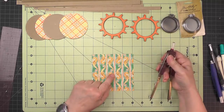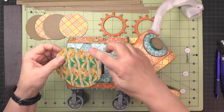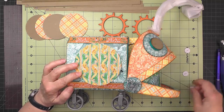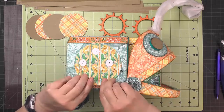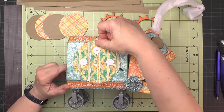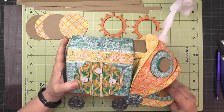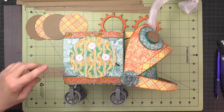Set the compass at two inches for the four-inch circle, then at an inch and a half for the three-inch circle. Cut it out around the four-inch side. Place it on the side of the body and let the magnets automatically seek out their place. We want about an eighth of an inch between the top of the magnet and the three-inch circle, and about a sixteenth of an inch between the edge of the circle and the edge of the magnets on the sides.